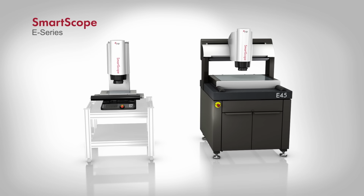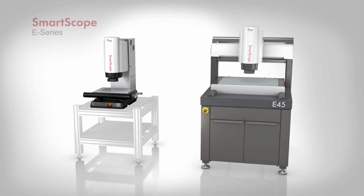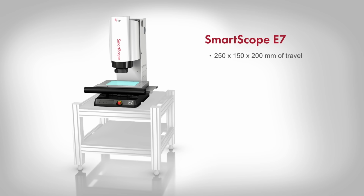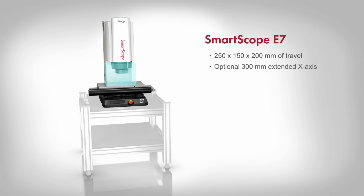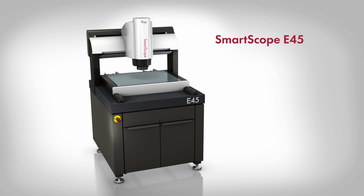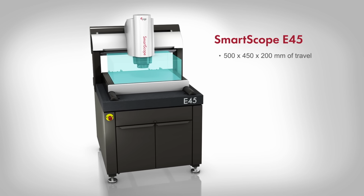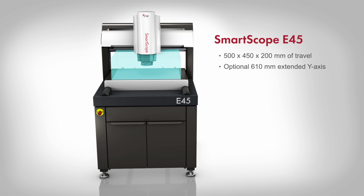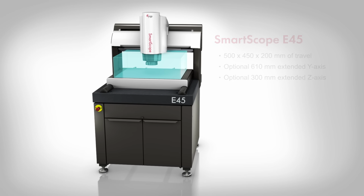SmartScope E-Series systems are available in two configurations to suit a wide variety of parts. E7 is a benchtop model, featuring 250 by 150 by 200 millimeters of travel. An optional 300 millimeter extended X-axis is available. E45 is a floor model, offering 500 by 450 by 200 millimeters of travel. E45 is available with an optional 610 millimeter extended Y-axis and 300 millimeter extended Z-axis.